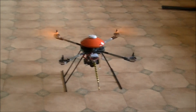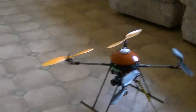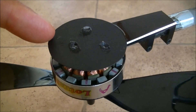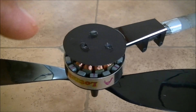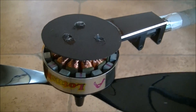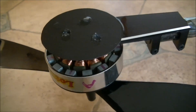That worked. We're back in action. All fixed. What I've done here is stick these plastic discs I've just cut out, glued them on here to protect the windings of the motor in a crash from branches and grass and sticks and whatever that's going to stab the motor windings and cut more wires. So I recommend anyone with this kind of quad or similar exposed windings on their motor just make some kind of shroud or guard to protect them.